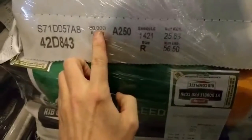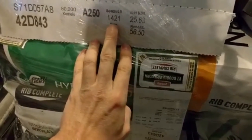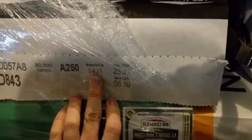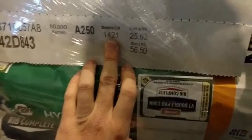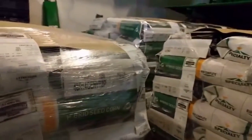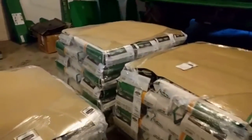There's also info on the bag itself — the lot number, variety again. 80,000 kernels. Pretty much all your seed corn, there's 80,000 kernels in there. What I'm interested in is the seeds per pound: 1421. I've got a chart in my planter book which will tell me which seed plate to use based on vacuum. There's a vacuum that pulls the seeds onto the cells of the seed plate. Now let's go to this 4814 variety — I got 1623 seeds per pound. Those may use different plates. We got a standard corn plate and a small corn plate, so that chart tells us which one is right. We also grow popcorn, so we have a special popcorn plate — actually last year our popcorn seed was pretty big, so we used the small corn plate instead of the popcorn plate, according to the chart.